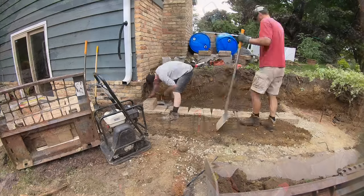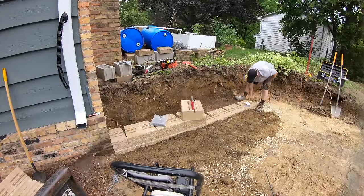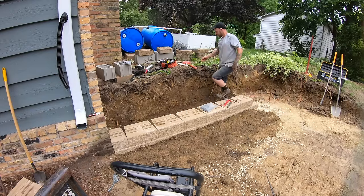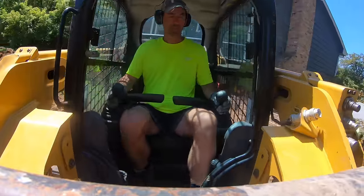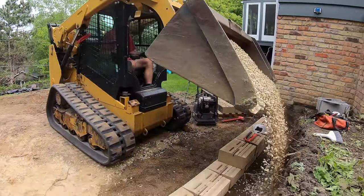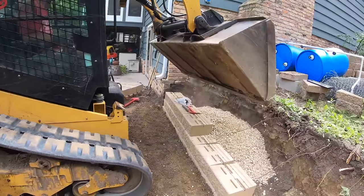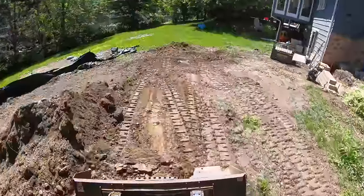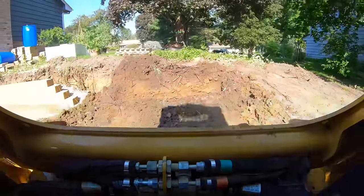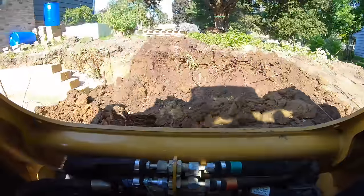After the blocks get based they've got to be toed in immediately. While Sam is basing and building, Blaine grabs a skid loader to bring in some backfill. Blaine has to be careful not to get any rocks in the series of lines and holes on the top of those blocks — if those get filled up with rocks they have to be hand-picked clean. They've been getting heavy rains every few days, so they didn't want to break the trench open all at once. Now they're on to the next phase and need to be very careful as they dig out the bank so they don't knock anything into the retaining wall.